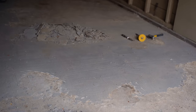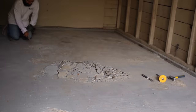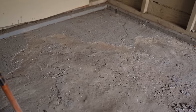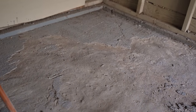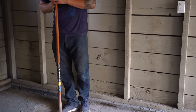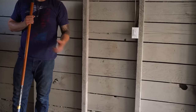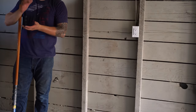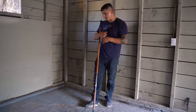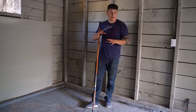As those chips came off, we came across a potential problem — a wet spot, like a dark spot. We wondered if there was water underneath, and it did seem like there was significant moisture. The moisture makes everything pop up; it's not sealed, so it makes patches pop right off. That explains why it came off really easily in that area. Over in the drier spots, it didn't come off nearly as easily.